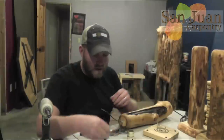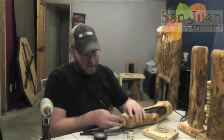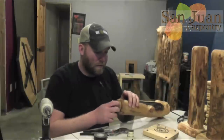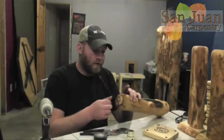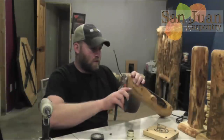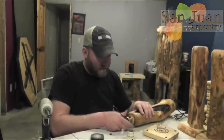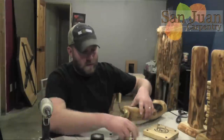And there it is. So now that we have our wire through, we're going to put the collar on — you can get those collars in a few different sizes. We're also going to put the lock nut on. Now if you have a harp that you're going to put on the lamp, now would be a good time to put the saddle on there for the harp before you put the lock nut on. We're just going to tighten that down with a pair of channel locks. And now the socket, or at least the bottom part of the socket — screw that on. Our threads did not get damaged at all, so that went on really easy.